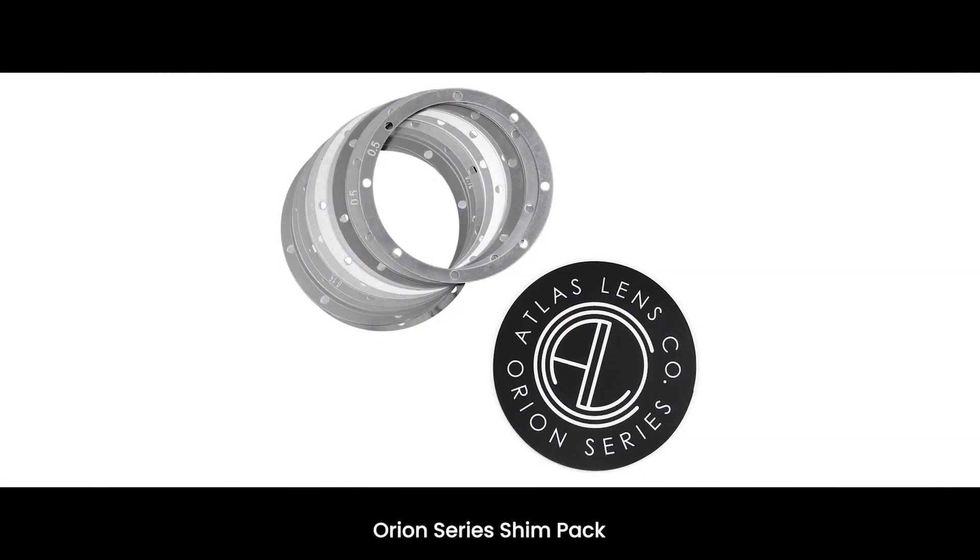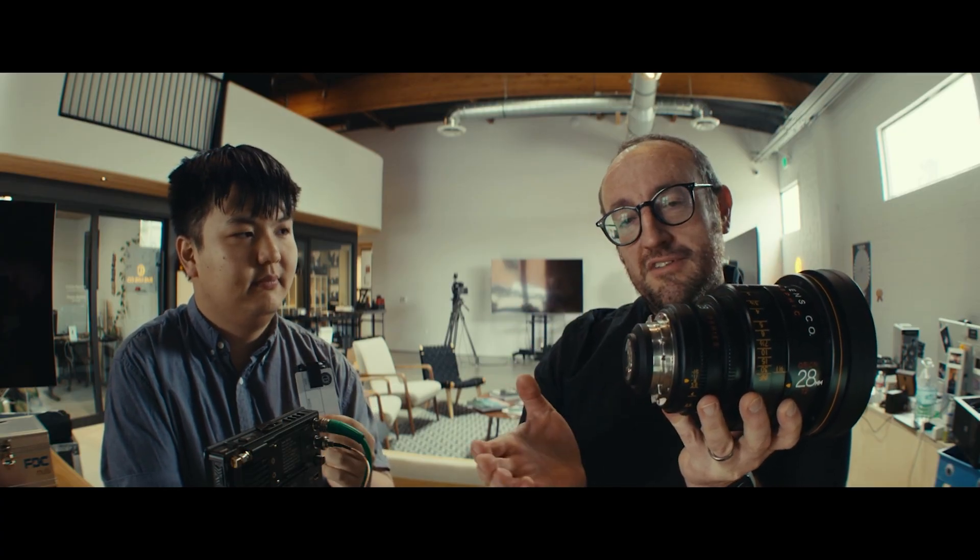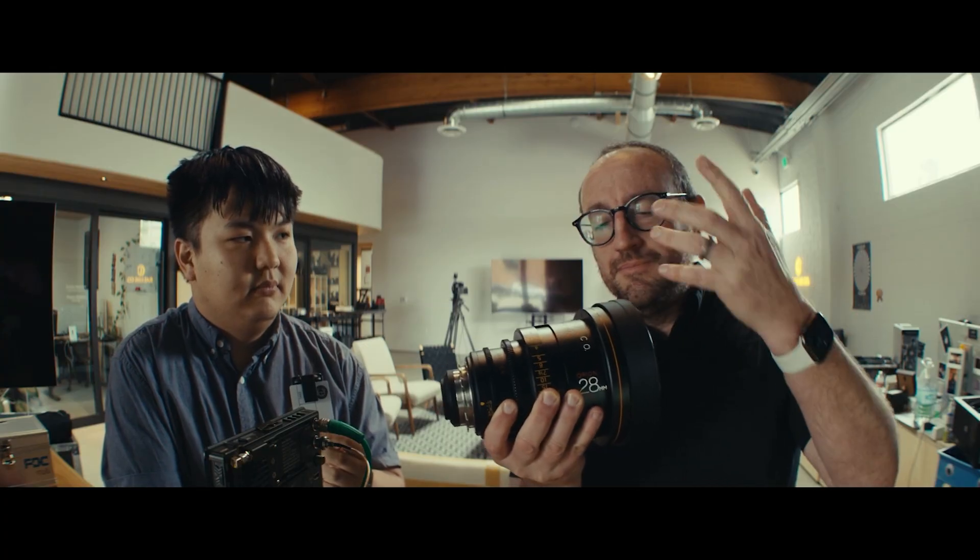When we're building a lens or calibrating it, we make sure there are shims that live under the mount that put this part exactly 52.00 millimeters from the image plane. We calibrate that to assure the best performance. There are minute differences between every lens — everybody likes to think all lenses off the factory line are exactly the same, but they're all a little bit unique because there are tolerances when you have 14 or more pieces of glass making up a system, with minute differences between each part and each air space.